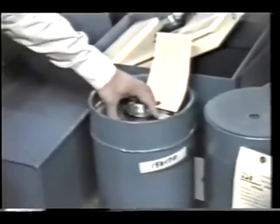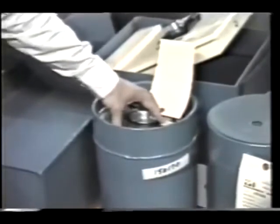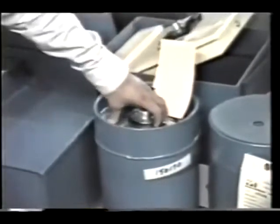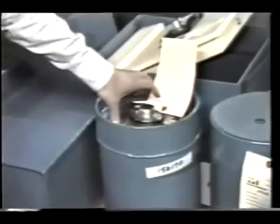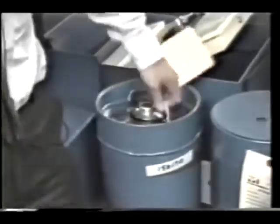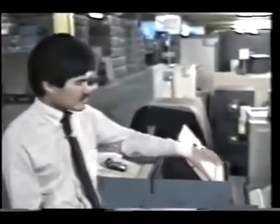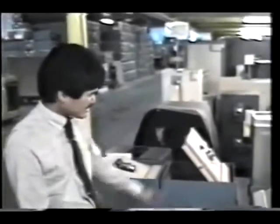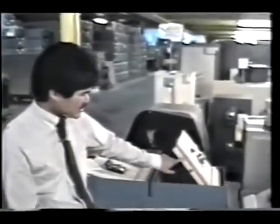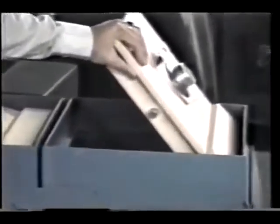Before, this type of safe by another company allowed one to take a sledgehammer. If you hit this area hard enough, all the bolts would break and allow the head to open. The majority of these safes that we've described for convenience stores are burglar-resistant safes. If you were to look at the door, you can see instead of the gauge steel we were talking about, we are now talking about 3/4 inch, 1/2 inch steel. This is 3/4 inch mild steel.